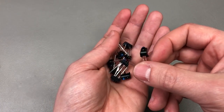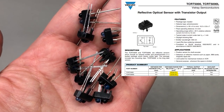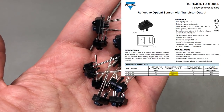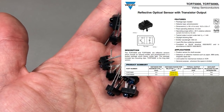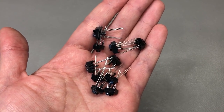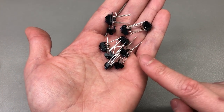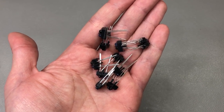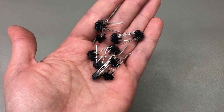I've also ordered a bunch of more basic IR sensors — an IR emitter and a phototransistor in a tiny package, likely a copy of the Vishay TCRT5000. The expected working range for these is in the 10–20 mm range, which is not sufficient for sensing people's presence in a hallway, but might be useful for detecting proximity of an object like placing your hand in front of the sensor. The advantage is that they are very cheap, basic, and reliable. However, you'd have to do more work implementing the circuitry — adding noise immunity in the form of a modulated signal driving the emitter — so you have to put a lot more hours into designing a sensor based on these compared to using the digital sensor shown earlier.